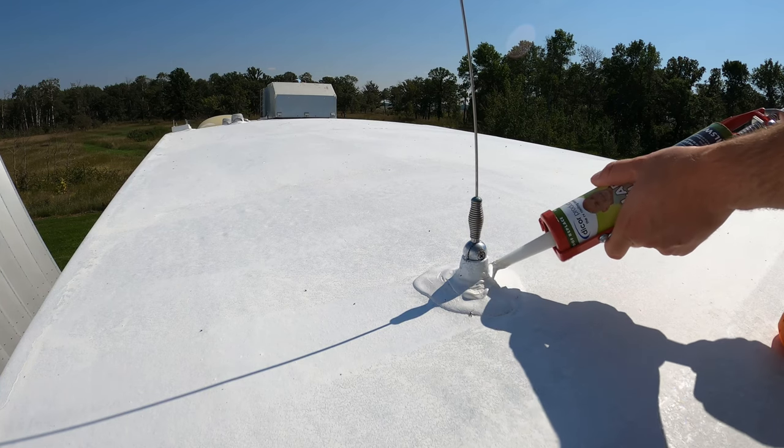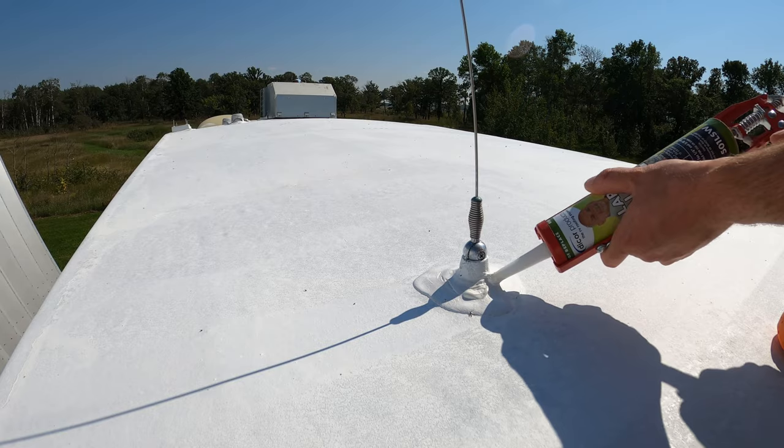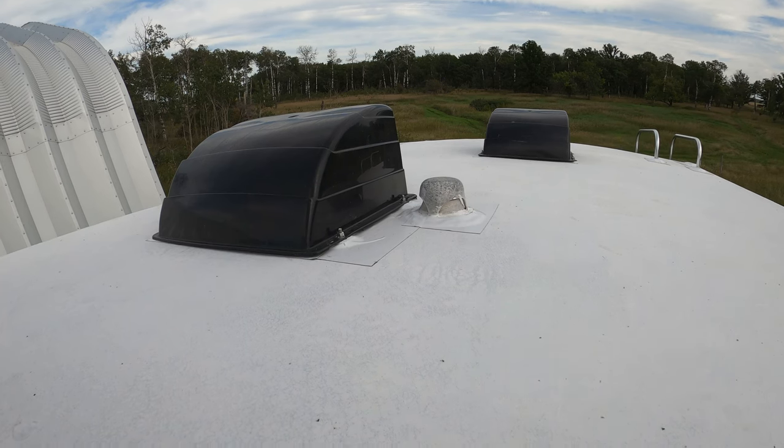What we're gonna do today: we were up on the roof, we redid the roof, we put some rubber coating on it, we redid the seams last video. So if you want to look at that, make sure to check out on our channel how to put lap sealant on. Now that everything is clean and taken care of, we're gonna put the Eternabond over top, and that will completely seal those seams so that we won't have to look at them for another 15 to 35 or however many years.